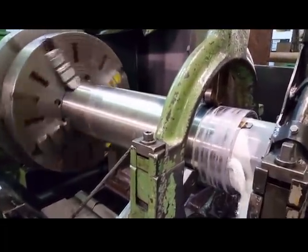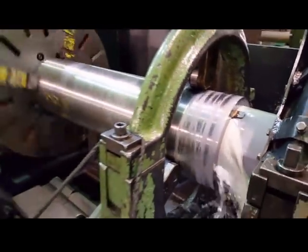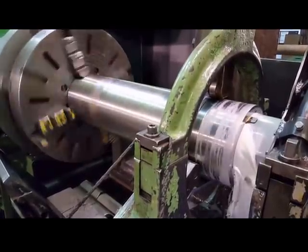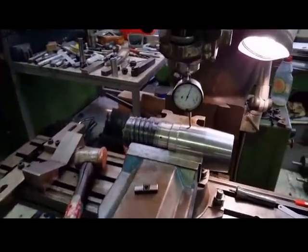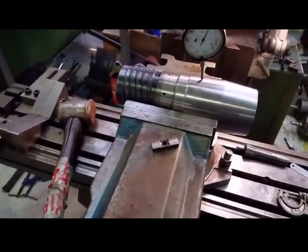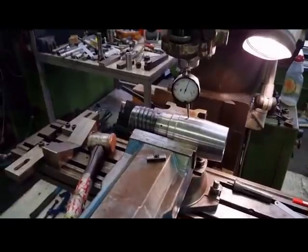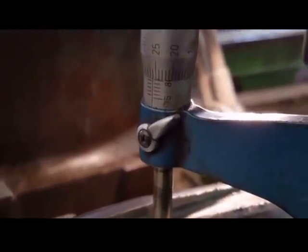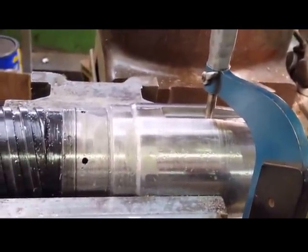Right, that sounds nice and quiet for the time being. Cutting it. Time to get on the bridge bore. I'm putting the pad pockets in first. 7.5mm thick. They need to be stud proud 2.5mm, so 5mm depth. Let me get the first one in. Exactly 10 thou deeper I have to go, 10 thou on each side.